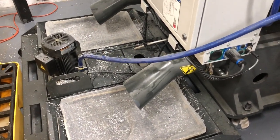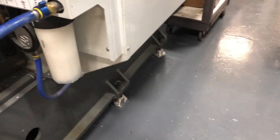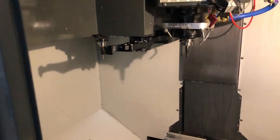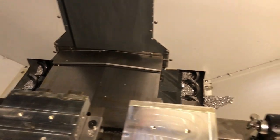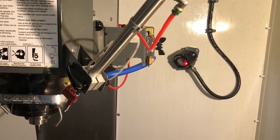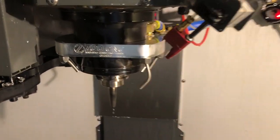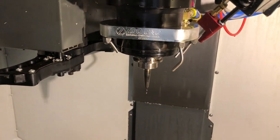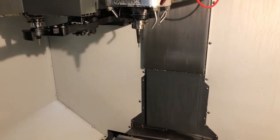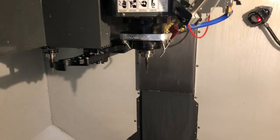In the back of the machine, those are the chip chutes — they dump right down into those trays. This is really messy right now, it shouldn't look like that. You've got a coolant filter right there. The panels on the sides of the machine are solid — there's no windows or doors. You can see inside it's got the augers, a tool probe, and minimum quantity lubricant misting. We've got one of our coolant rings on it, so that's not a Haas factory thing. It came with a pretty decent setup, just not quite as efficient as one of our coolant rings.